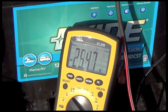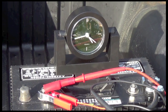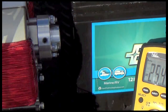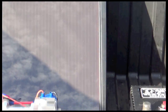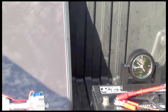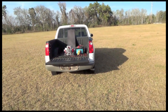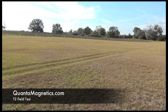One last shot — it came up to 25.47, still rising. In not even an hour, it went from 25.38 to 25.47. Not bad for six watts of input from a solar panel dancing behind clouds, outputting a measly 15 watts, though we're only drawing six. It was a good test. You can tell by the shadows that it actually is late in the afternoon, and we are in the middle of one of my farm fields. Thanks a lot for watching.